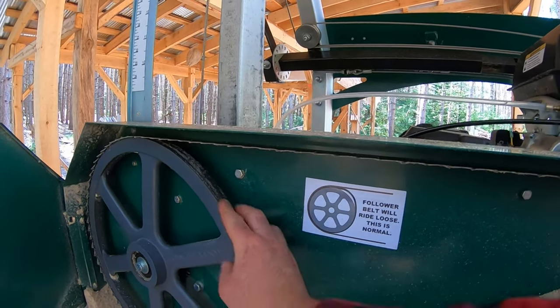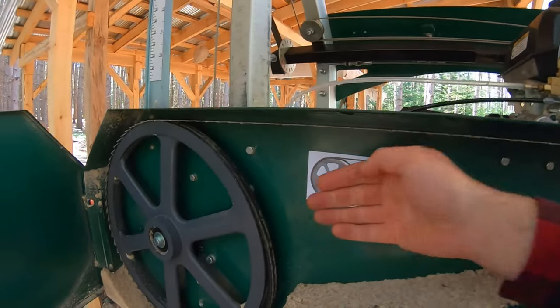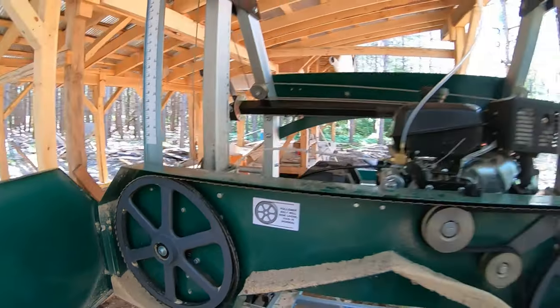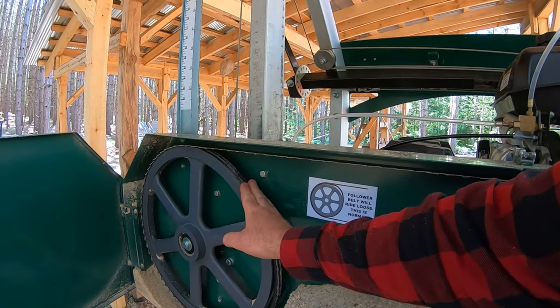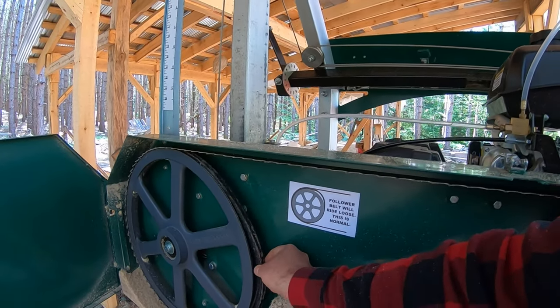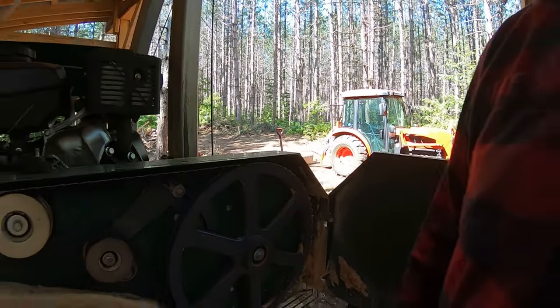If that sawdust is coming off no problem, then look at the condition of the belt. What I'm looking for in terms of damage is things like chunks or cuts in the belt. If that belt is not going to allow the blade to sit flat on it, or if the belt won't sit flat in the groove of the band wheel, then you could potentially have the blade on a slight angle as it goes around the band wheel. If that happens, it has the potential to make the blade creep forward or backwards, and you'll notice that in a hurry — when you start up the sawmill and add power it'll be like pop, the blade will be off. Check both the follower side and the drive band wheel belt.